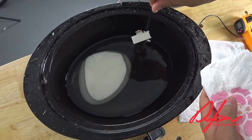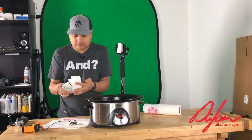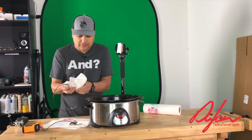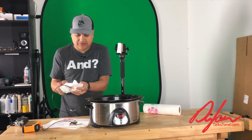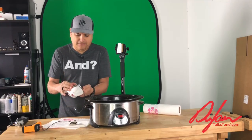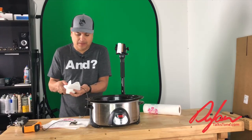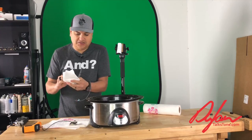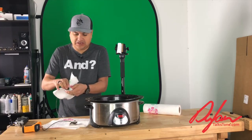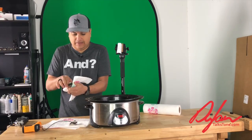Do this safely so we're not spattering anything. You can see the excess wax on the outside of the pickup — wipe that off and get it as clean as possible. This pickup is going out to a customer, so we'll sit at the bench for a fair amount of time to make sure it's nice and clean and looks great before packaging. For those of you at home wanting to re-wax pot a pickup that's been wax potted in the past — maybe because it started to squeal — the process may go more quickly. And that's really it. Super simple process.